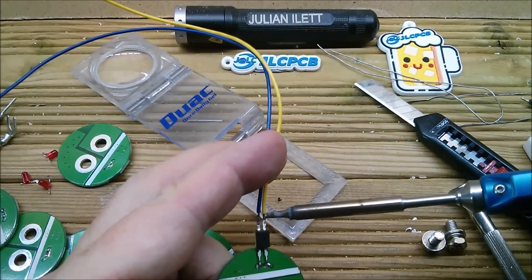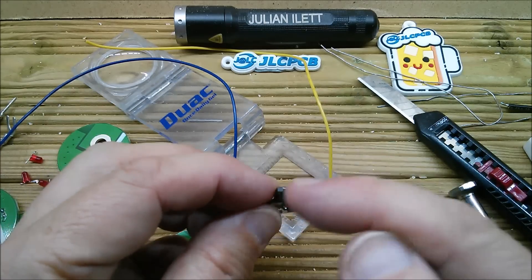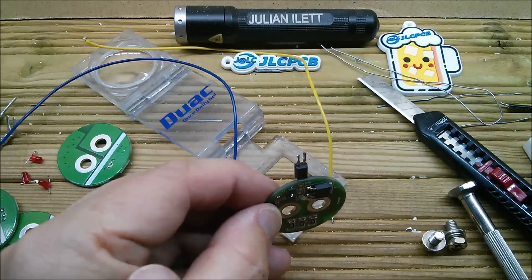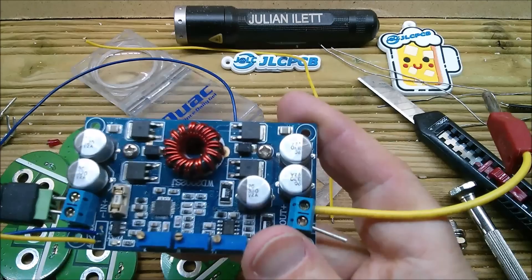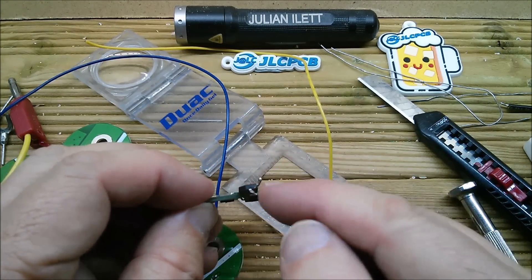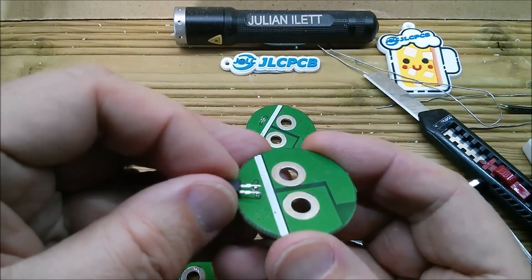Now I need to get the optos and get these wires off. What I'm going to do once these are in position on the caps is bend one of these legs one way and one the other — one back, one forward — and then run essentially some bus bars across here, because all these opto-isolators are in parallel. As soon as the first one turns on it pulls the line low, and that line goes to my disable switch position on the high current power supply and turns it off, just leaving the low current supply on. Pins one and two bent to the underside of the PCB, three and four bent to the top side.